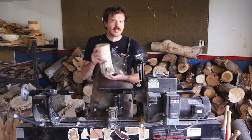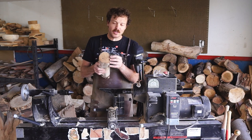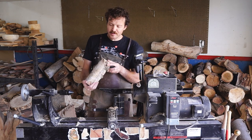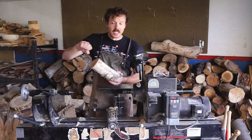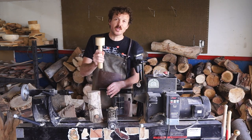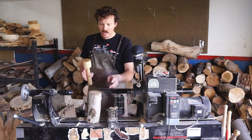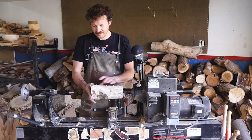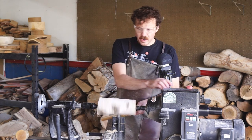This is a good example of a first-time size piece of wood if you're turning a vase for the first time yourself at home. The one less-than-optimal thing about the paper birch though is its bark — you'll often get bark that wants to separate and come off very easily. This feels like it's actually going to stick around just fine, but if it felt sketchy you could take a chisel or a hatchet and peel all the bark off. For now, let's put it between centers and get to turning. This is my first use of the ash mallet that I made in my Pennsylvania video last week. I have a very, very technical method for finding the center of a log. Start with our roughing gouge and get to roughing.